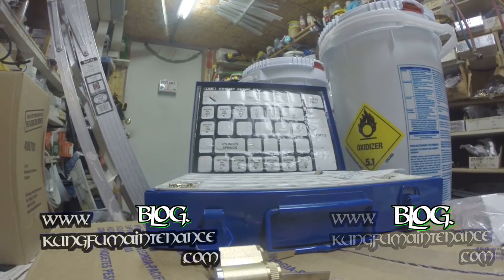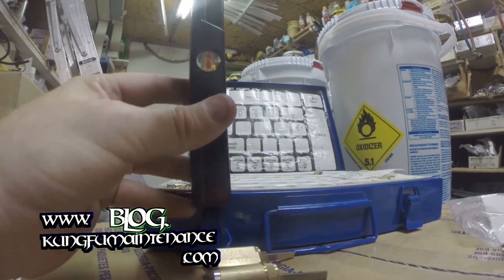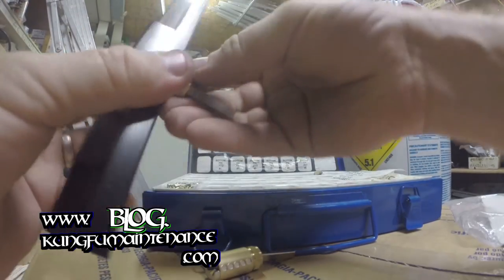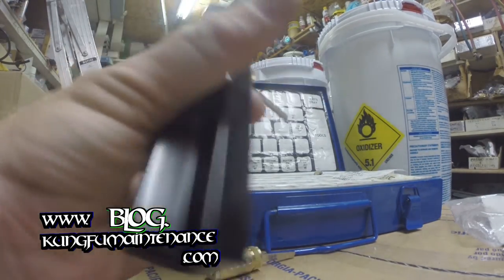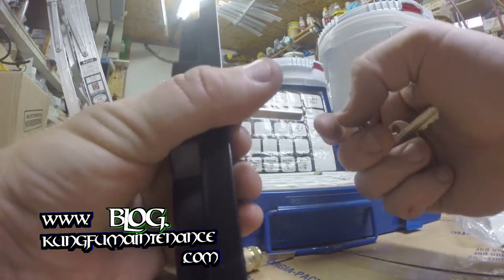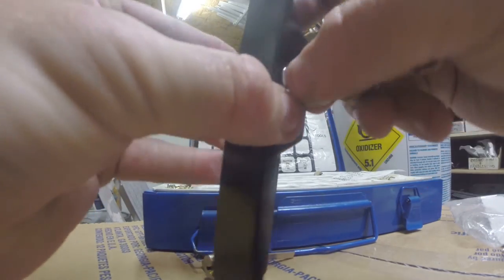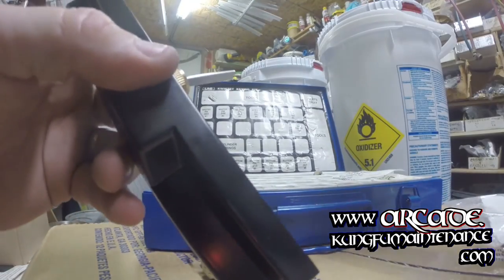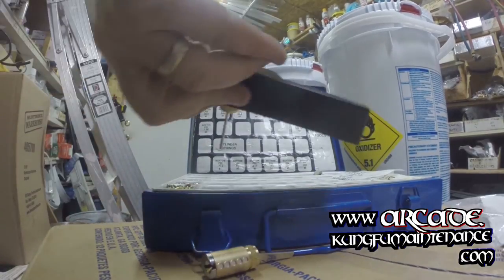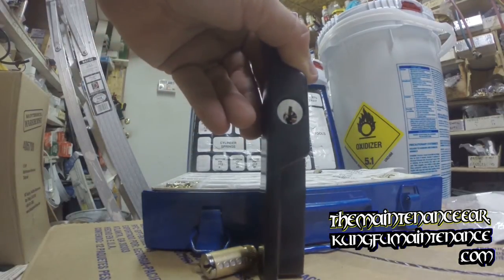This will just go in the back of your patio door. The only tricky spot is which way the cylinder rotates to work with the handle — that's the only tricky part, but it's not too hard. You just try it both ways until you find the way that works with the handle, both to latch it from the inside as well as to lock and unlock from the outside. Good to go — that's how you can rekey a patio entrance.